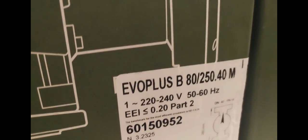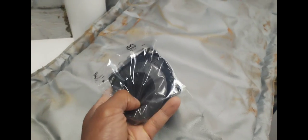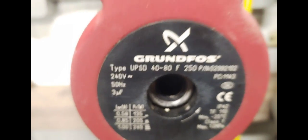It's not a direct replacement — it's a DAB pump that's going to be replacing this. We've got the pressure nominal number there, and sometimes you can get the diameter nominal number. Sometimes the valves can seize. This is the pump it's going to be replaced with — a DAB Evo Plus. There's the pipe bridge if necessary, going to isolate further back down the circuit. This is the blanking plate if you're going to blank off the head of the pump. Just sizing it up to see if it will fit — notice the 250 labeled on the pump after the F, so I need to make sure that matches.